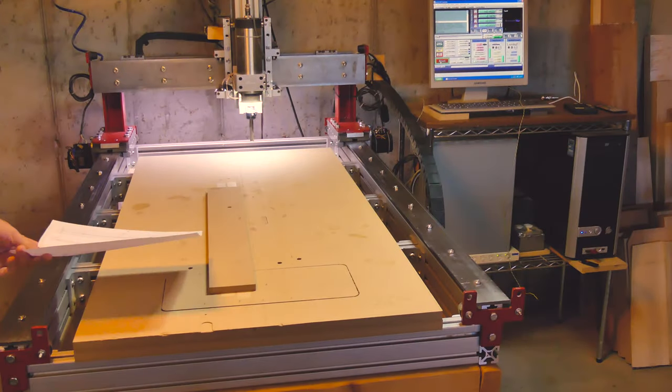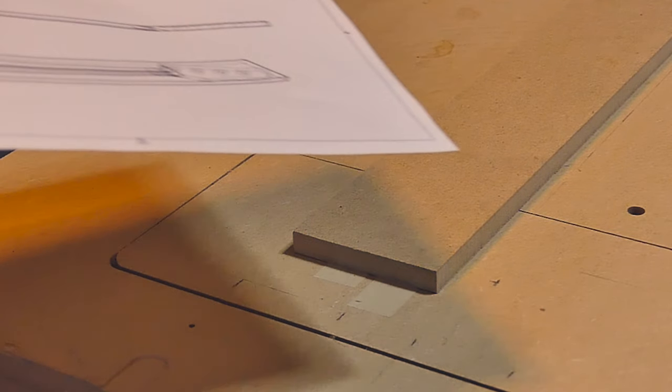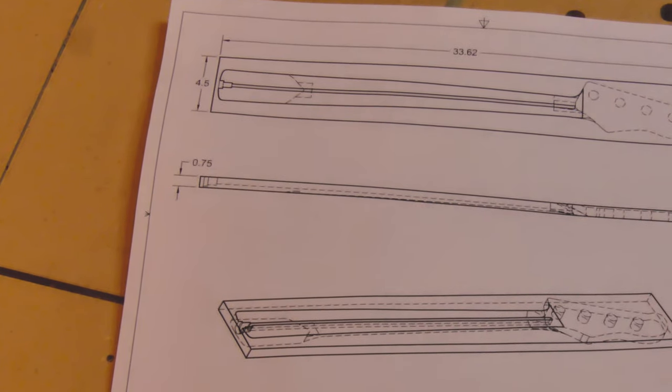The first thing you're going to need is a technical drawing. I have skipped this step and paid for it on many occasions. Not only will it save your lazy butt from a bunch of trips back to the PC to check where you've set the origin on sequential milling operations, it will make the process a lot more enjoyable.